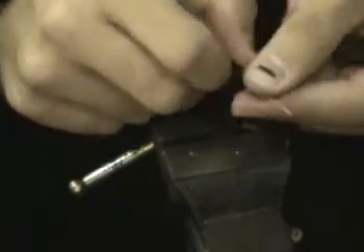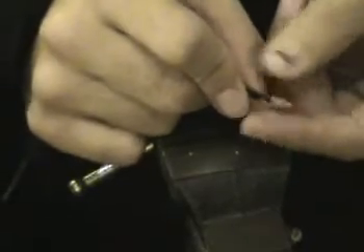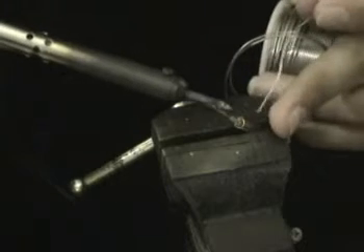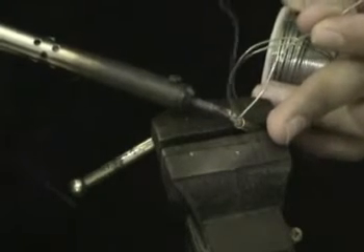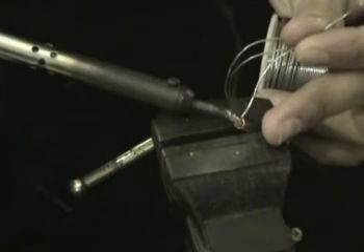I retract my statement earlier. It is actually easier to put this bottom half on after you've pulled all of this back. Once you pull all of the shielding back, feed this through the neck and out the top, and you can expose this a little bit. Taking the soldering iron and some solder, try to get this affixed. Remember, don't use an excessive amount of heat — you don't want to melt any of the important stuff on the inside, and you especially don't want to ground anything.